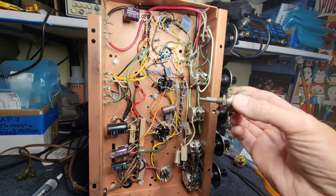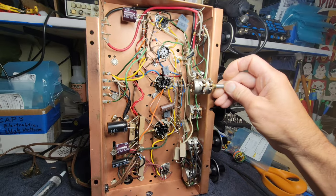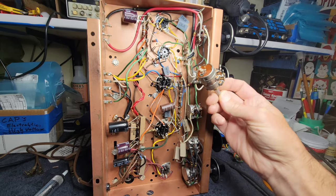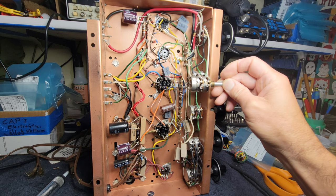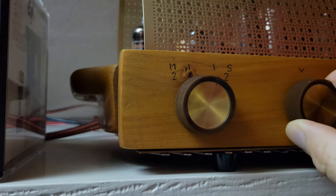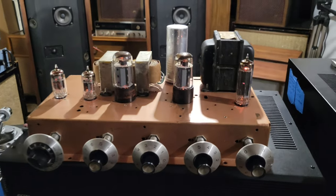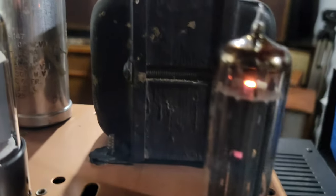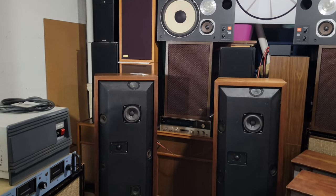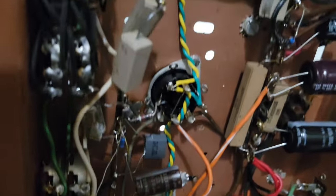I need to add an on-off switch, and I just happen to have such a thing — it has the same values of the pots and an on-off switch integral to it. Let's turn it on. There is still an ever so slight hum, but that's from the transformer. There's no noise that I can hear from the speakers. So it was those filament wires — I'll show you what I did.